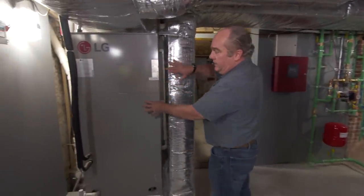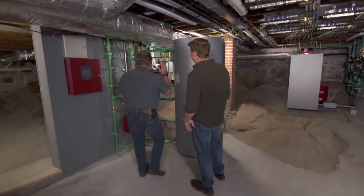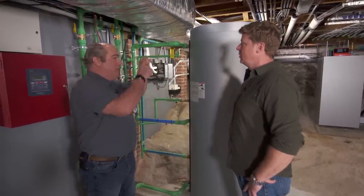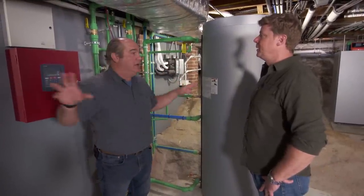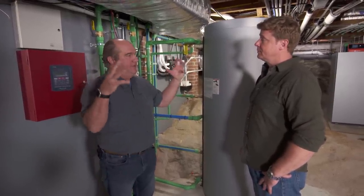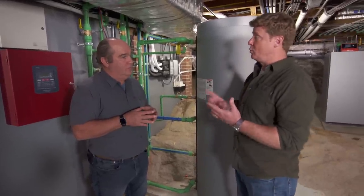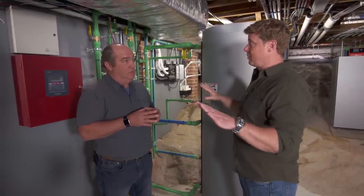Here's an air handler right here on the first floor — you can see refrigerant lines right here, and this goes to ductwork here on the first floor. The refrigerant lines for seven different units inside the building come back here to distribution boxes like this. These connect to two outdoor super-efficient inverter condensers outside. Up in the office, we've got a picture frame unit. Out in the exercise room, we've got a ceiling-mounted unit. We've got a couple of small air handlers and air handlers down here on the first floor. Not to mention all the new insulation makes this place tight as a button. And it's a reminder that if you're going to insulate, you've got to ventilate — you've got to bring fresh air in. We've got this big range hood with a stove and had to bring in fresh air and preheat it in the winter. New plumbing mechanicals, plus our electrician gave us new electricity — we've got a solar array on the roof, a new generator outside, and an additional 200-amp service pulled to the house. Everything mechanical is new in the entire home.